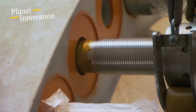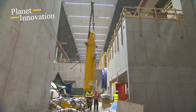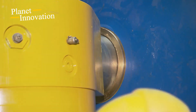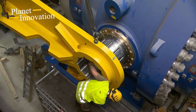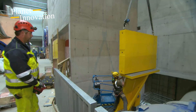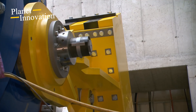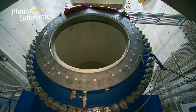The high-voltage cables are routed from the dam wall of the reservoir lake through the cable and escape tunnel, with the help of thrust devices and cable winches, up to the 220 kV switchgear drawn into the machine cavern. As the machine cavern approaches completion, the upper half of the stator, weighing 112 tons, is placed on the lower half and screwed to it. The movable rotor lies in between, in the transition area between the two halves. The rods still have to be soldered together and insulated to complete the work.